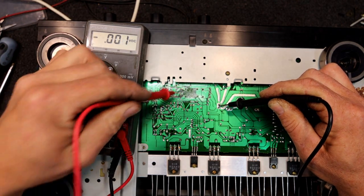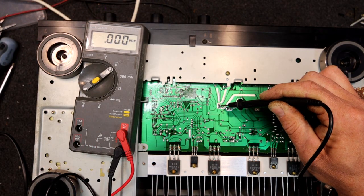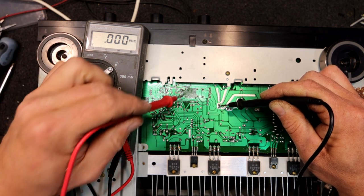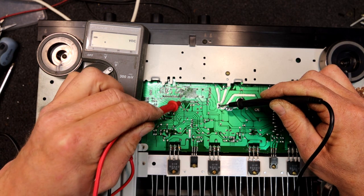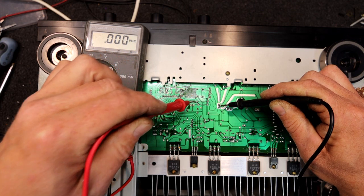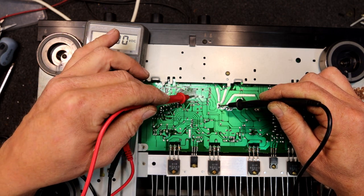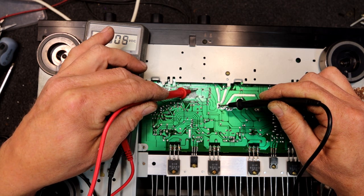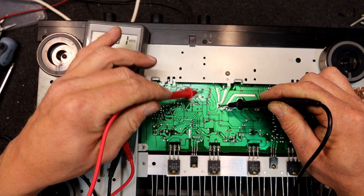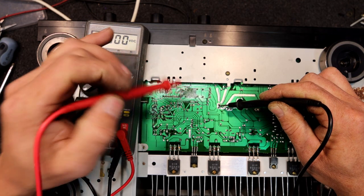There's no DC now. The two pins far away are next to this little chip, and the two that go to the speaker connectors are the switches. The coil should get around 12–24 volts with ground on the other side. There's no point measuring the speaker side of the relay if it's not clicking in, because it'll be disconnected — that's the whole idea. This little chip measures the output of the amp; if there's any DC it prevents voltage going to the coil so the relay doesn't click. You have to go to the terminals hooked to the amp outputs.